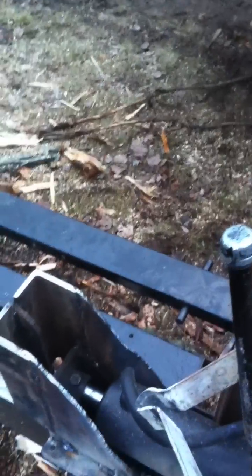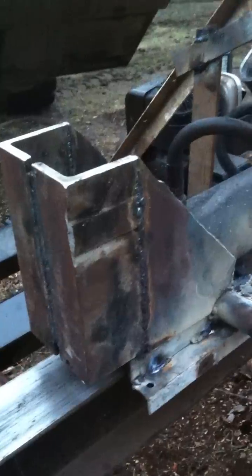To save time, it's nice to not have to hold that handle down while it's extending. And that pusher plate was a little too short to split two halves into quarters, so we made that a little taller. And this is all just scrap I got laying around, so it's not perfect or nothing, but I put a table at the end so heavy halves don't fall onto the ground.